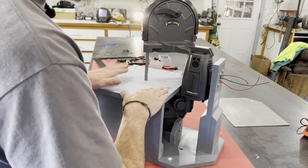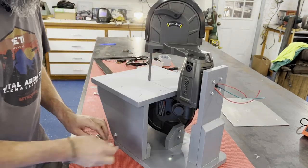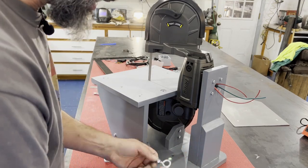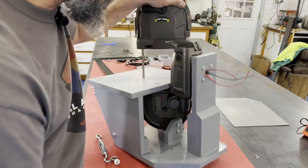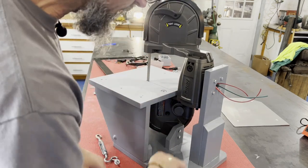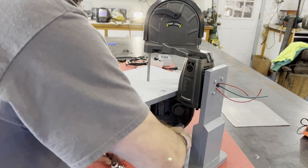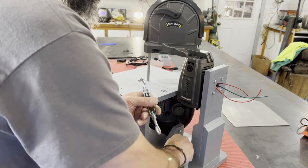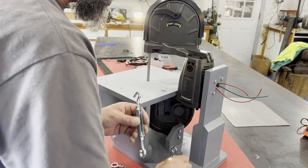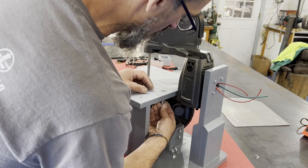You may be wondering how I'm holding the table down rigid — let me show you. I almost overthought this, but last minute I just used an eye bolt with a T-nut in the top of the table, located where they'd clear everything, cut them to the correct length, and I'm using a turnbuckle to clamp this down.